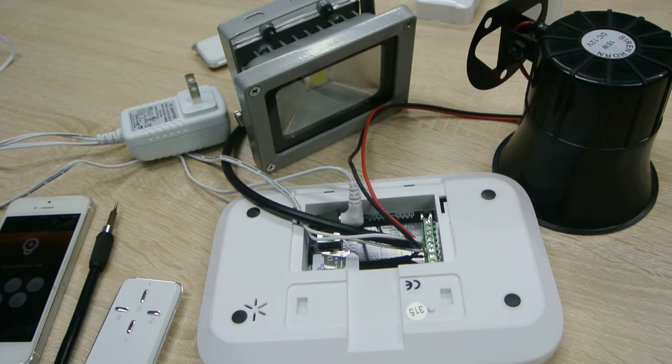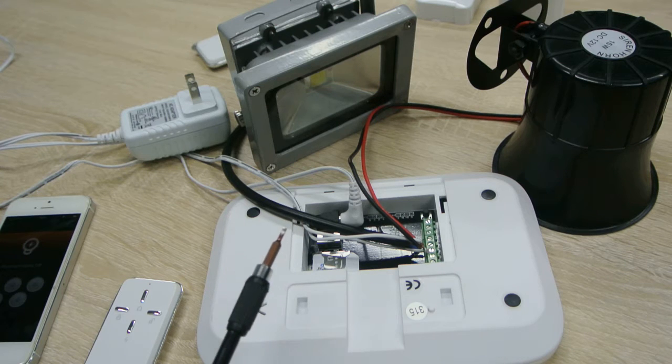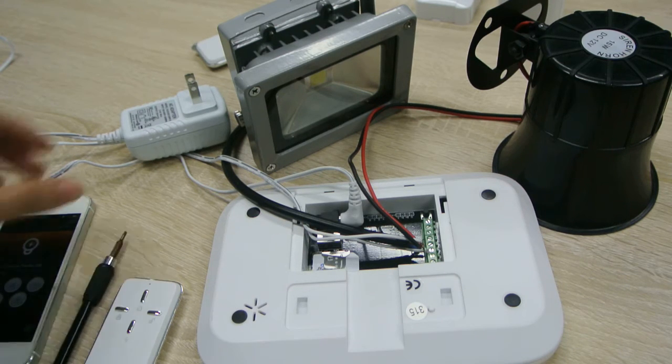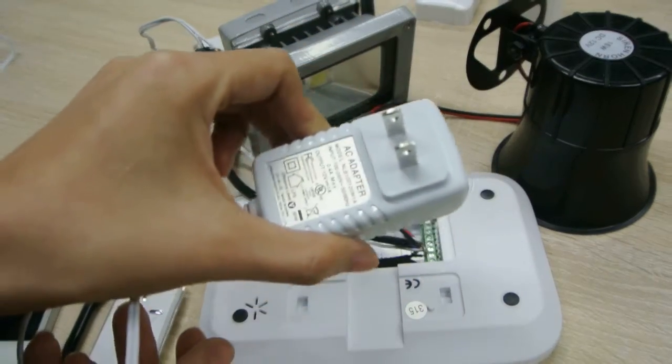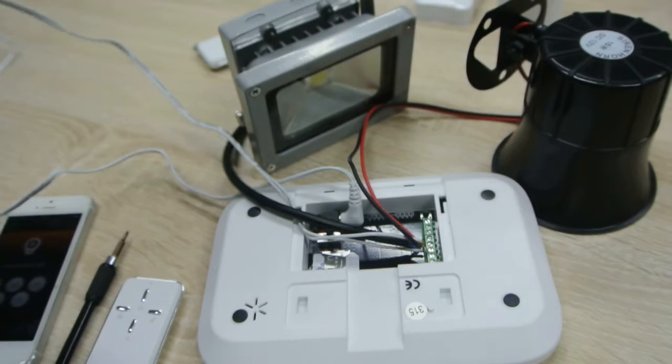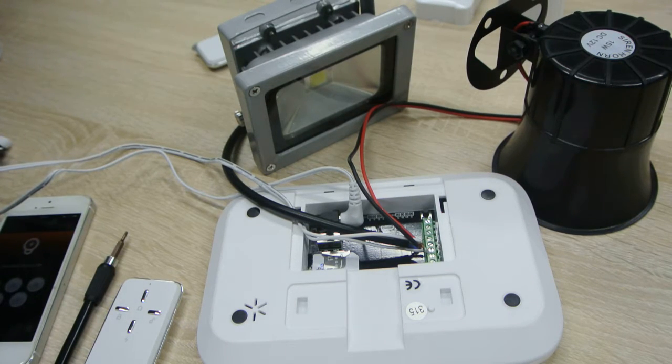Before connection, the tools you need are a flat head screwdriver and a power supply to power the siren or AC facility. This is a power supply output. The siren or AC facility will draw power from this unit, so you need to make sure the output meets requirements. Whatever siren you decide to use, you should understand the current draw of the siren to see if you need a higher-rated power supply.